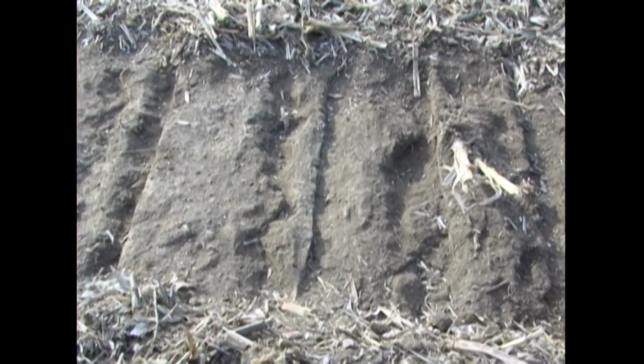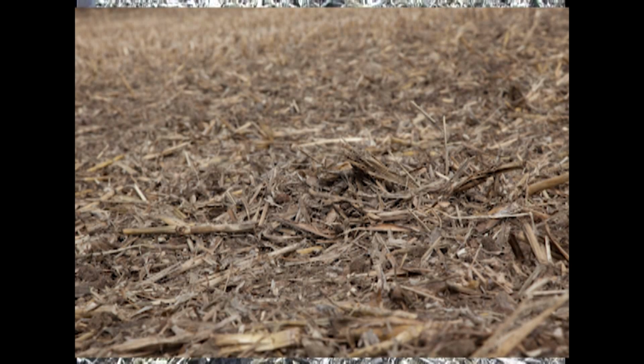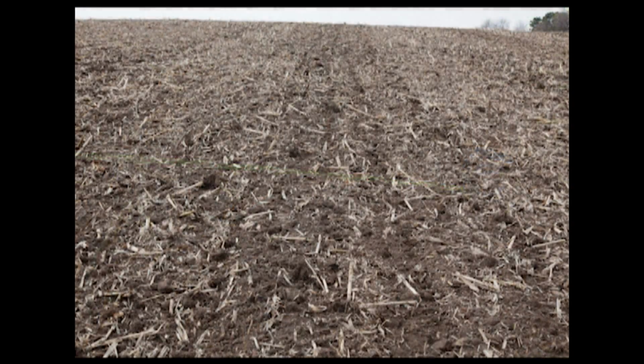Our second competitor utilizes individual discs, but as you can see, the bottom of the seedbed is anything but flat. Variations in the tilling depth have resulted from shank movement as the tool is pulled through the field. The depth varies significantly in just a few inches, and the harrow and reel combination used is simply not aggressive enough to properly level the field.